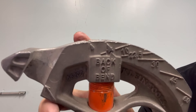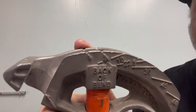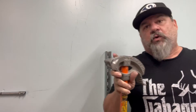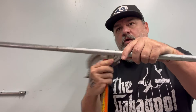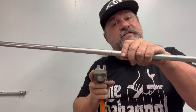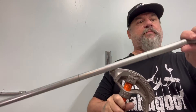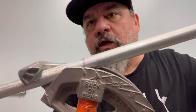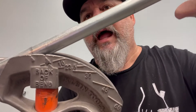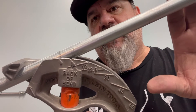You ever see those two notches on the bender? The first one's called the rim notch. It's specifically designed for three-point saddles. So no matter how you put this pipe in the bender, one way or the other, it will always be the center. We're going to bend our three-point bend on that notch. We put our pipe in with our center mark, and we would make it parallel — the bottom of this pipe would be parallel with that 45 degrees, so we'll have a perfect 45-degree center point.